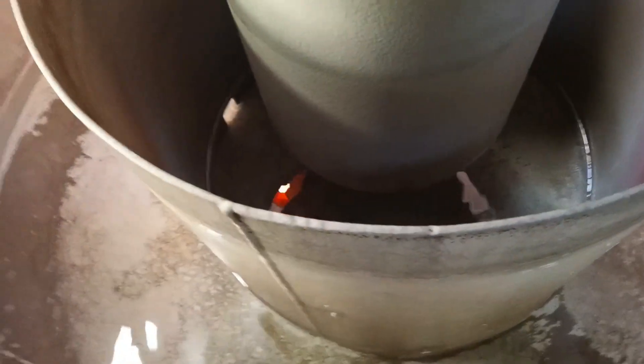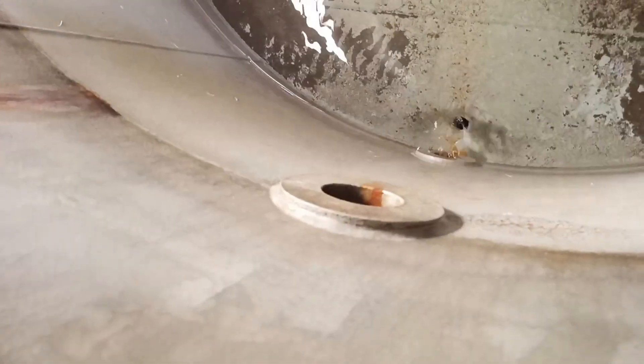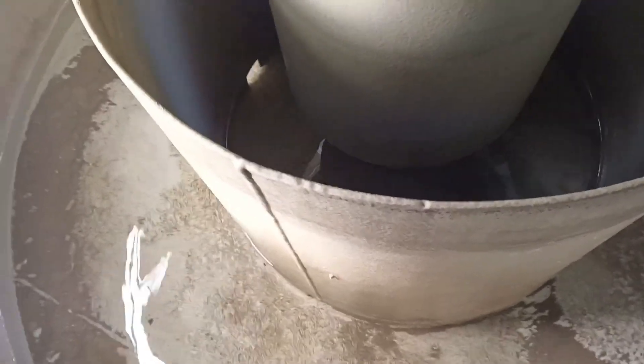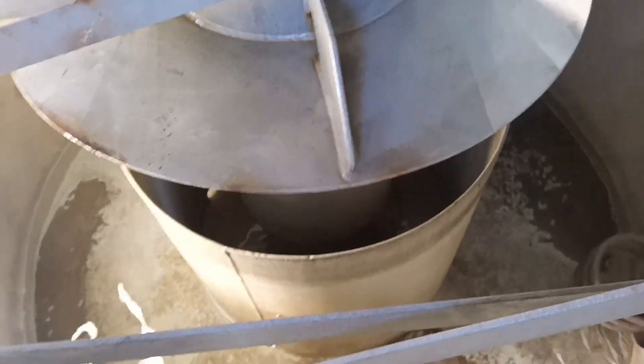This is our IG. What exactly is happening — you can see this is the location from where your IG is coming from the engine room. There is a continuous slight waterfall you can see from that position. There is a water line, and there is also a heating coil which can be used. The IG is basically coming in from here and from here it will go to the tanks. So this is the layout of your deck seal.